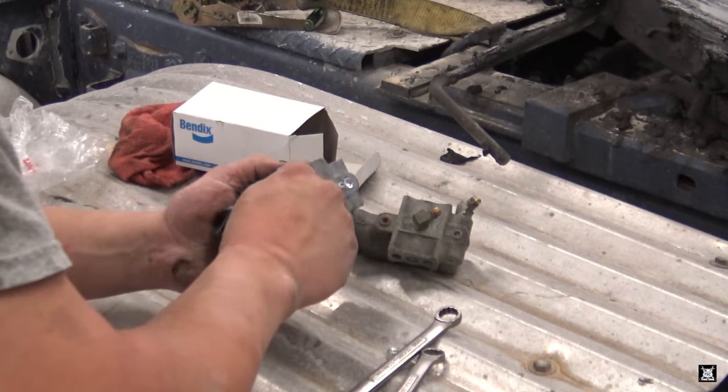Excellent. All right, next, have to do is mark or notate the direction that nipple is. So it's basically at a 45, not pointed quite to the corner, but just a touch over. Matter of fact, it points right to that notch right there. Well, take your half inch wrench, spin them out. I'm gonna put new thread tape on here though, so stand by.